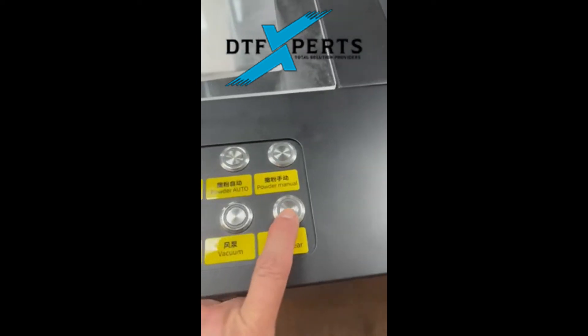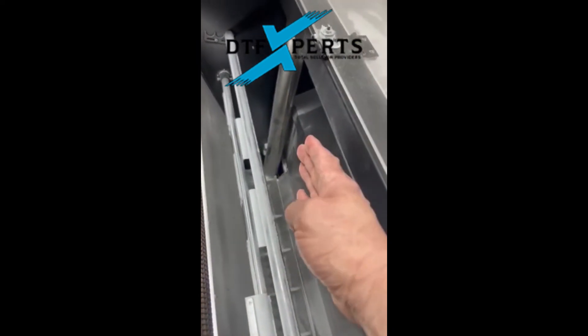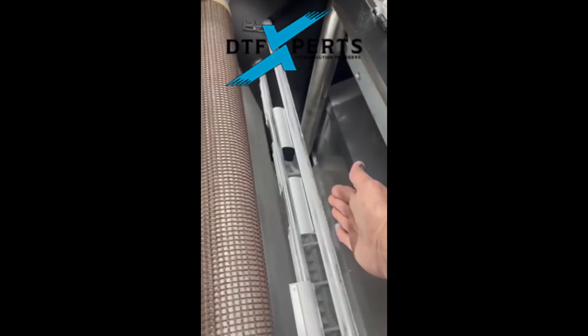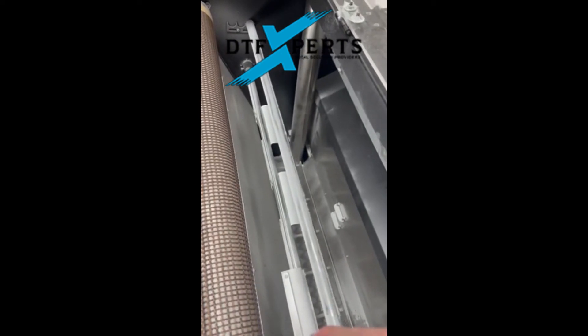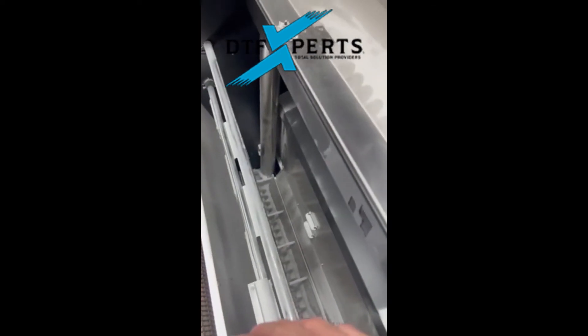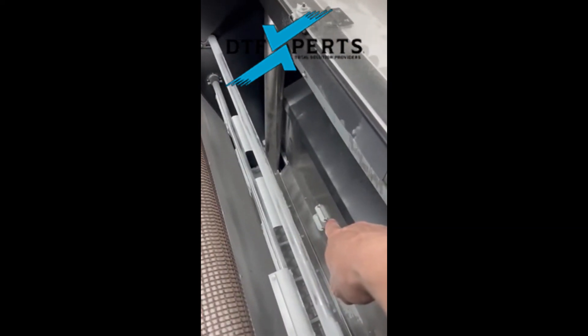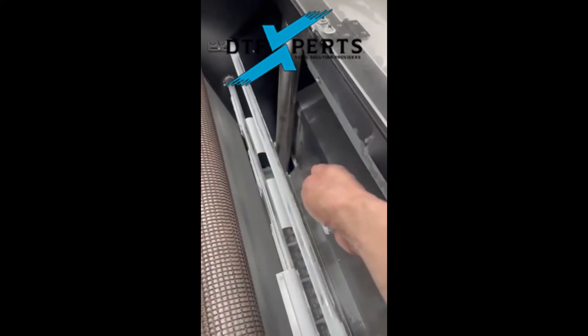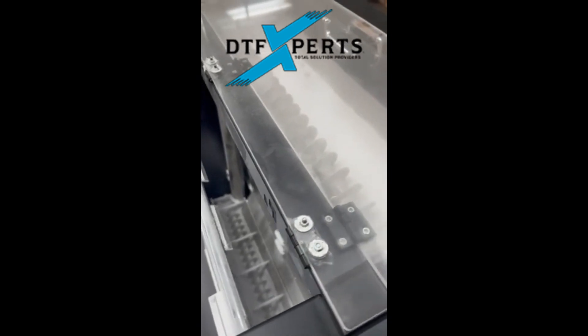Last on this, we have the powder clear. When we turn the powder clear on, the film will actually come out of the printer, drop down into the chamber, come back up — it's filled with powder — comes back over this, and then it'll sit right here. And that's how we start it. When the run starts, the printer runs, feeds film, gets down to the sensor, cuts on, and as it's coming back up it's beating the extra powder off of it, and our duster is dusting it.